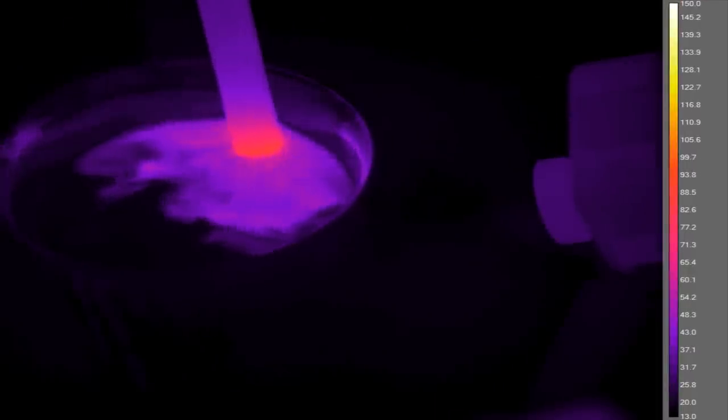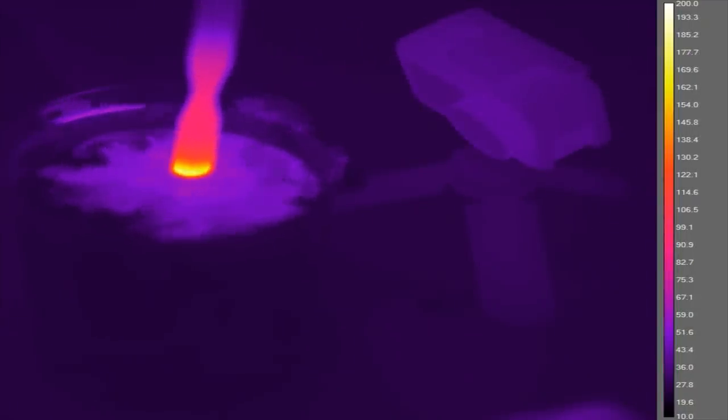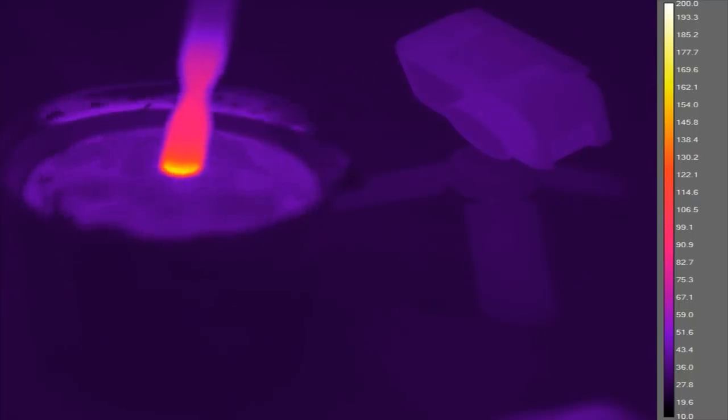And because borosilicate is much easier to work, you can make much more intricate apparatus from borosilicate than you can from quartz. But if you have high temperature applications, particularly high power bulbs, the bulbs in the old projectors, the bulbs in streetlights, in xenon headlights in cars, these are made from quartz because borosilicate would just melt and wouldn't be strong enough.